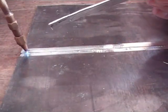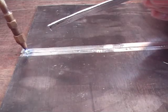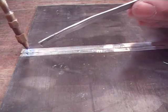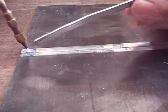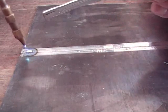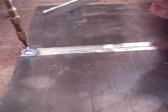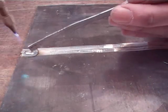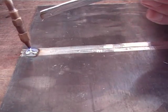First I'm going to preheat the lead on both sides of the sheet where I'm going to weld — left and right, so it's a bit molten. Don't burn it right through. Then I'm going to put a small amount of lead on there just to get started, making sure it's the width and height of the weld I want. The height of the weld should be roughly the thickness of the lead you're welding, maybe just a little bit smaller, to give your weld strength.